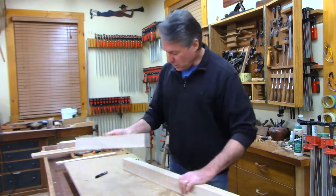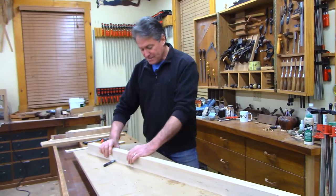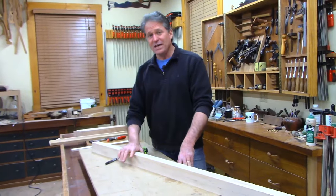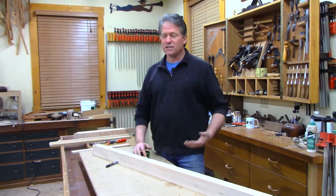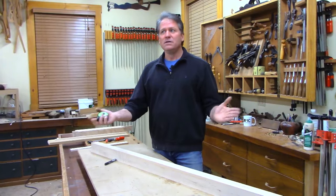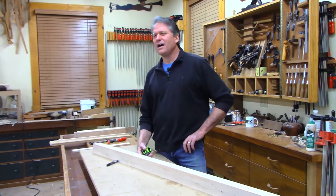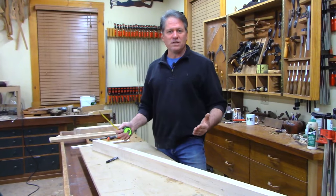All right, so to get organized with this piece, I'm thinking I need, because this piece is 2 3/4, I'm going to need 7 of these to get over my 18-inch width, because 7 × 3 would give me 21, then I lose 7/4, so I'm down to 19 1/4. All right, so we're going to end up with a little less than that by the time.